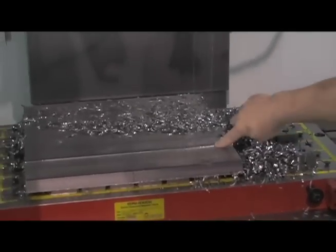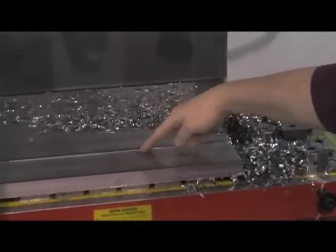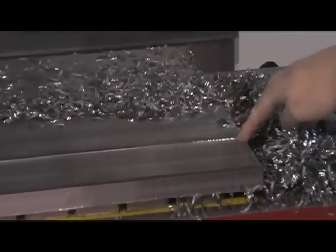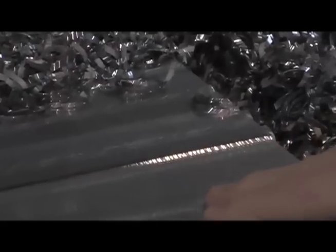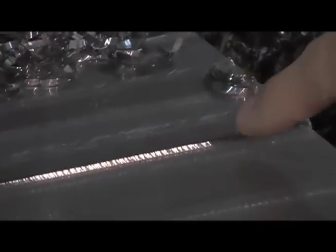As you can see, the chatter marks on the wall are created by vibration due to the fact that there's no dual contact with the cutter itself. These are actually the cutter flexing and coming back against the workpiece, and you can see that that's almost like a serrated edge.